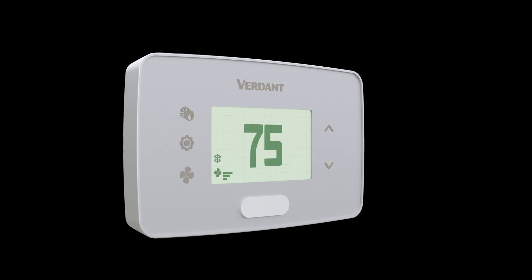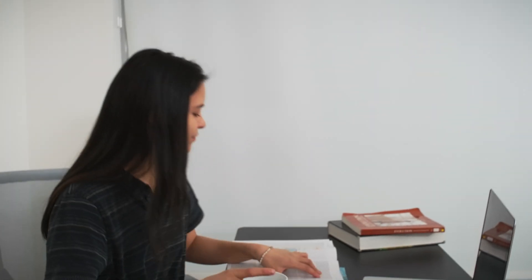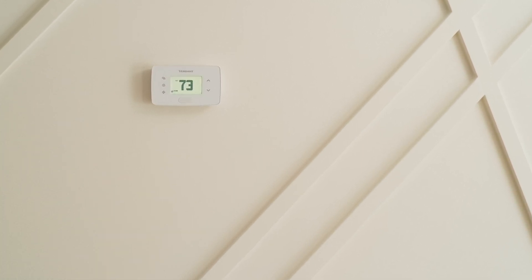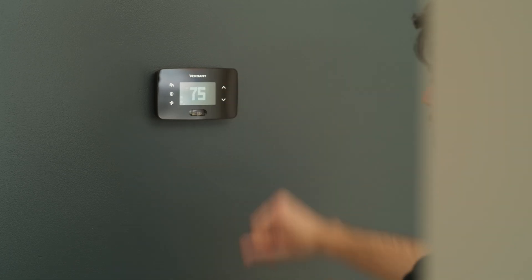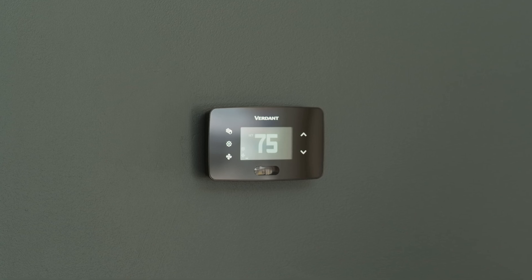Let's review some key considerations for installing the Verdant VX4 thermostat. Ensure the thermostat's occupancy sensor is directed towards the bed area, or the spot where the occupant will spend most of their time. Choose a location where the thermostat can effectively detect maximum occupancy. Avoid placing the thermostat near large metal structures or surfaces like metal air ducts in the wall, as these can block the wireless signal. Also, don't install the thermostat near windows, door vents, on an exterior wall, or above or below supply vents, as these areas can affect the thermostat's performance.